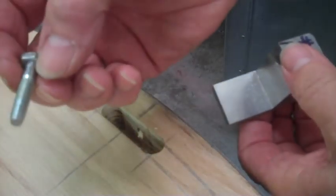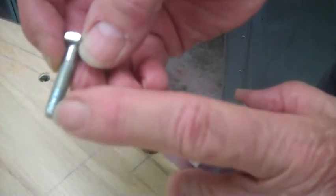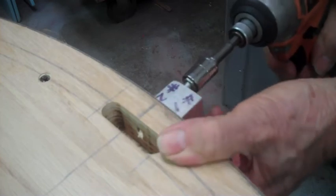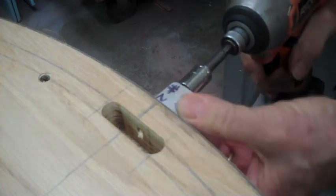And to line it up, here's a quarter 20 bolt, and I've taken the sander and put a taper on the end, kind of like a self-tap. And we put it through the quarter hole. I'm getting pretty good at slinging. I've got a pair of quarter inch nuts that I put in the socket, and every time I do this, I sling them across the room. But anyway, we put that in the number 7 hole, screw it in like so, and there went the nuts on the floor again. Oh well.